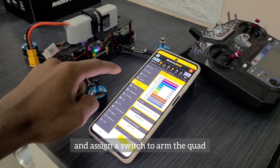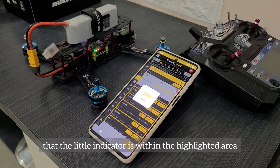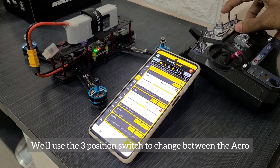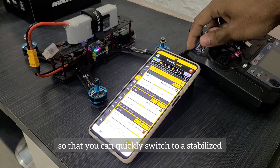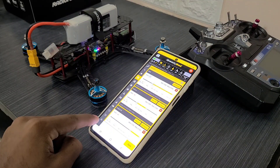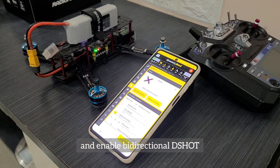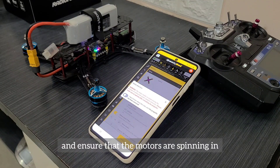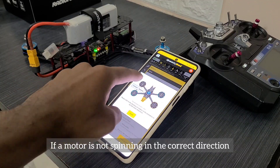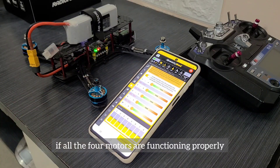Now let's head over to the modes tab and assign a switch to arm the quad and change flight modes. Click add range and flip the switch you want to use to arm and disarm the motors, and adjust the slider so the little indicator is within the highlighted area. We'll use the three-position switch to change between acro, angle, and horizon flight modes — acro is not listed because it's the default mode. Set the range such that the quad is in angle mode when the switch is in its center position, so you can quickly switch to a stabilized mode from either acro or horizon. Go into the motors tab and select DShot 300 as the ESC protocol. Disable ESC sensor, enable bidirectional DShot, and change the static motor idle from 5.5 to 15 percent if needed. Click on motor direction and ensure the motors are spinning in the same direction as shown in the animation — if not, click forward or reverse to change direction. Use the master motor slider to check that all four motors are functioning properly.